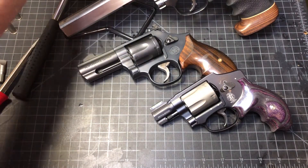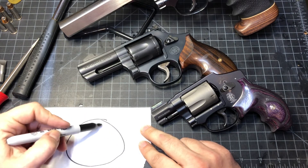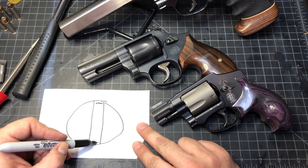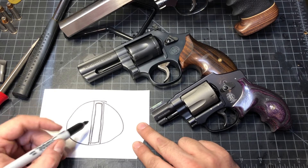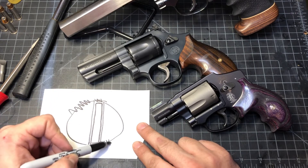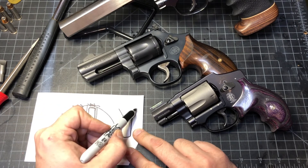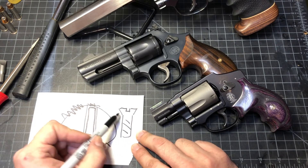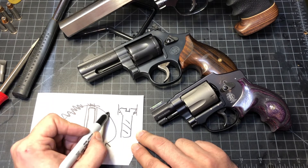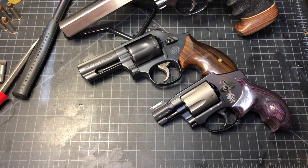Making sure you've got a total fit right off the hop is really important. We want our screwdriver to fill as much of that screw slot as possible. If we go out here into the fray, the screwdriver is going to drag on the outside of that mortise, and what we're going to end up doing is creating peened-out material there — and that is not going to be good for our finish either.